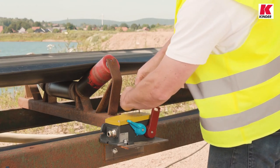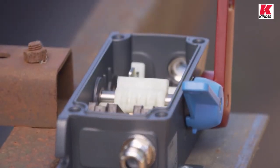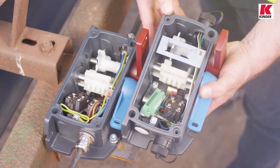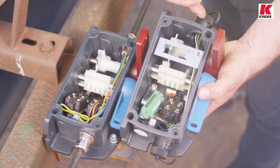Emergency pull wire switches mounted along conveyor belts are often cabled in series, and that is exactly what we have here. In this case, we need conventional electrical connectors and two cable entries in the housing. The ZS92S is available with a maximum of four cable entries. Alternatively, there is also a variant ready for connection with the Dupline Safe Module, making the electrical connection a matter of seconds.